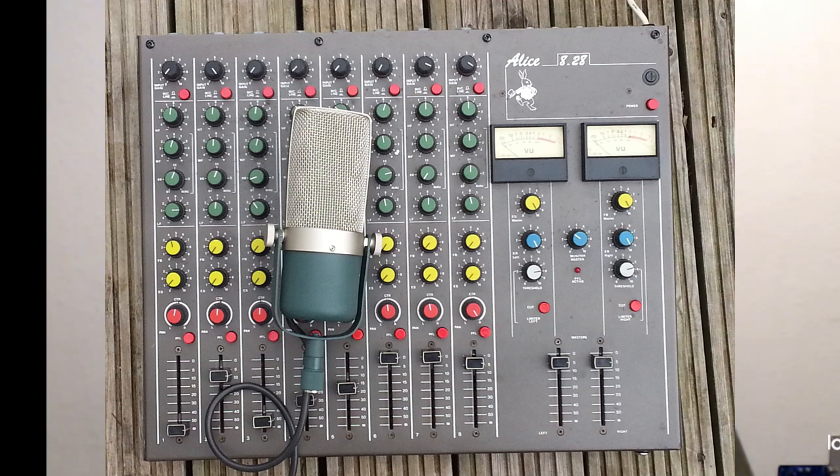When a transient hits an amplifier, all its feedback systems and current controls hit the end stops and cease to function. For a fraction of a second, the amplifier is immobilized, and it takes further fractions of a second to get restored to normal operation. So the audio overload is first distorted, and then the amplifier takes recovery time to get back to normal. Bear in mind, all this is happening in a very short space of time, making it almost inaudible. What does this sound like? It's difficult to generalize, but in many cases the effect is to sound normal and clean, but at the same time slightly thin and gravelly.